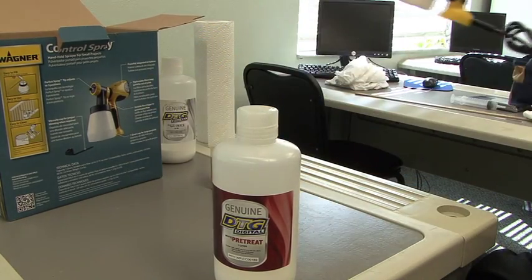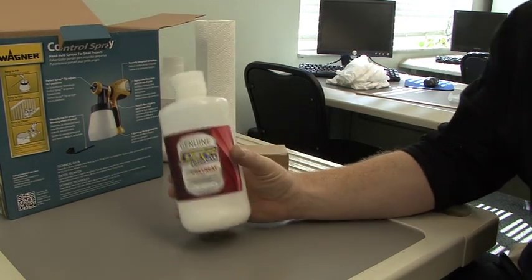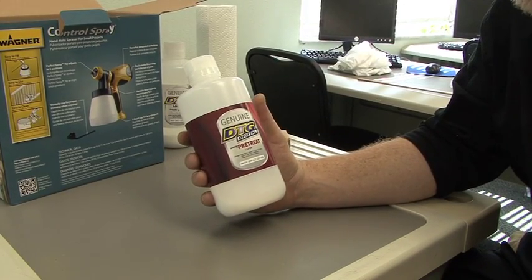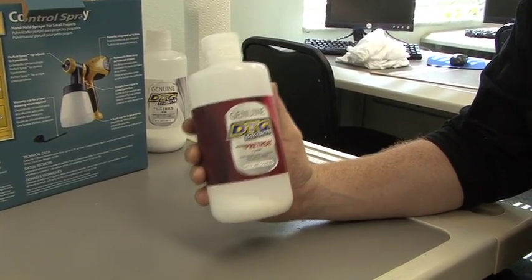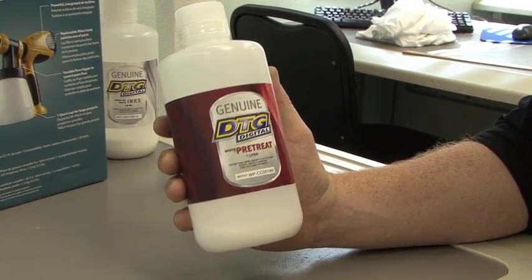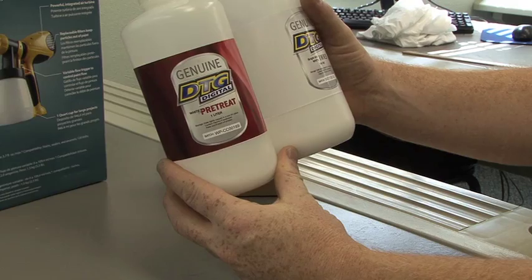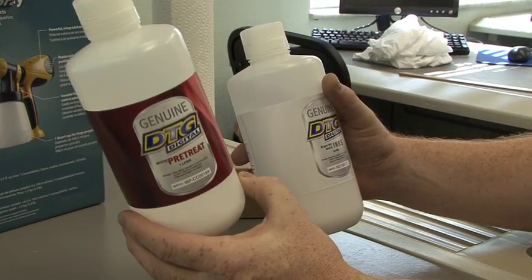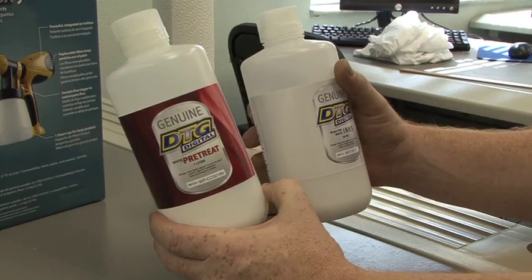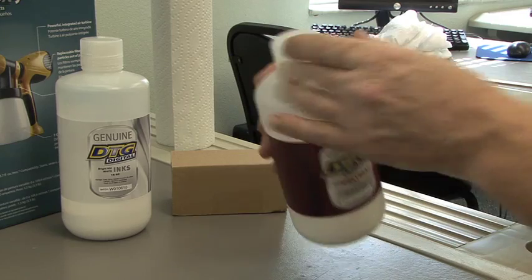Alright. Pre-treatment is basically like a saltwater and polymer type solution. You will want to keep these bottles in a different location than you keep your ink. Reason being, if you forget and choose the wrong bottle, say white versus pre-treatment, you pour this into your white ink reservoir, you're going to have a very expensive repair. Let me show you what it actually does to white ink.